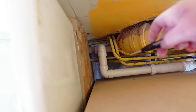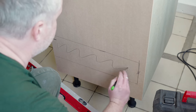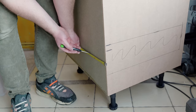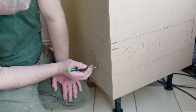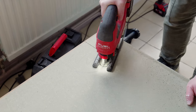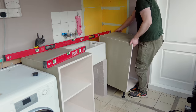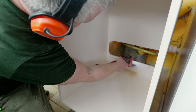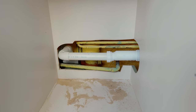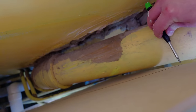When I look at this end it looks like I'll be able to keep this side panel intact, so I'm just going to make a mark roughly there. I started marking out and my main concern was that I would be taking away some of the structural rigidity of the unit by having to cut so much material away. It looks like it's going to clear at the top but there's one more copper pipe down here that I missed. The multi-tool came in really useful on quite a few occasions on this project. I'm going to hold my pencil as straight to this pipe as I can get it and scribe a mark onto the back panel.